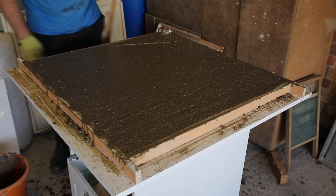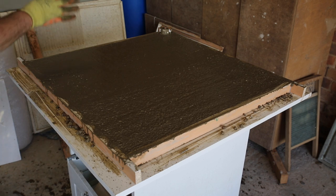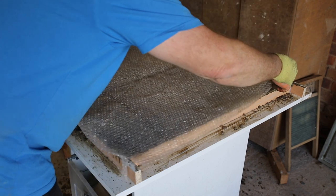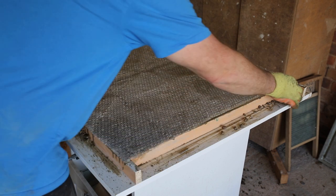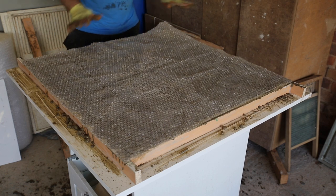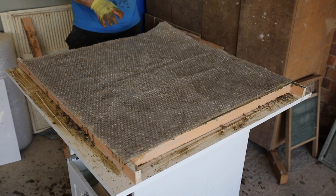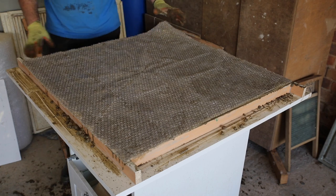So we'll leave that for now and leave well alone. I'm going to cover this with a sheet of polythene — I have a piece of bubble wrap here that's just the right size. We'll leave it covered so it doesn't dry out too quickly. Concrete is a chemical reaction, not just drying out, so we need to leave it covered — especially on a hot day. You can probably take the mould out after one day, but I'm going to leave it for two days.